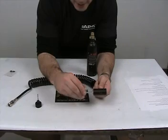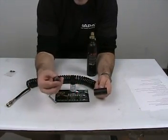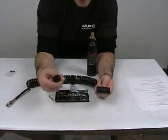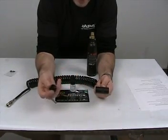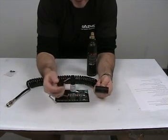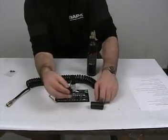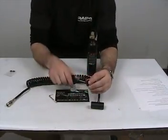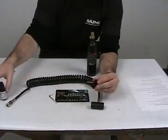The reason you tighten it is because you want to create greater friction between the shaft and the o-ring. So when you reinsert the shaft inside, it will create a seal for you once it's tightened to the correct setting. And before you insert the shaft, you want to apply lubricating oil so that you do not damage the o-ring.